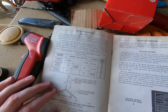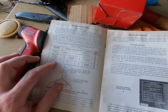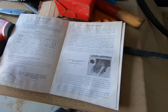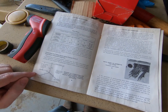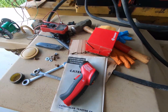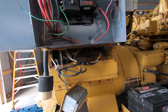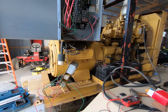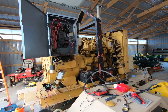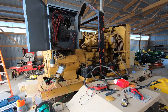You can even wire this for single phase: single phase two-wire low voltage, single phase three-wire low/high voltage, single phase two-wire high voltage. I've got to figure out what exactly is going on and learn a little more about this machine — that's why I bought it. I didn't necessarily intend to have to rewire it like this, but we will get there. At the very least, I have a D311 running Caterpillar engine, even though the governor is all wrong for it. Got any questions or comments? Leave them below. Thanks for watching.